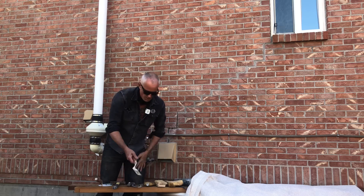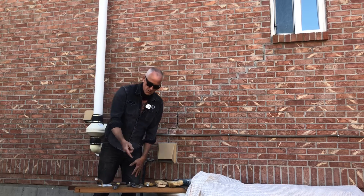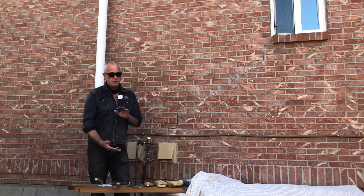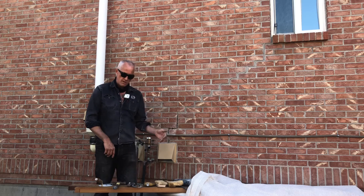It's mixed and it's going to harden just fine. There is this idea that you have to make it really wet for it to harden up, and that's not the case. Cement will harden. This cement will harden in a bucket filled with water — it'll go to the bottom, it'll settle, and it will harden inside a bucket of water.